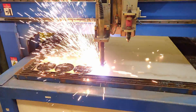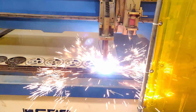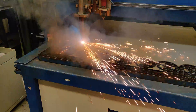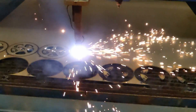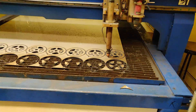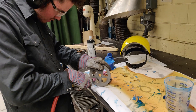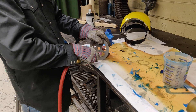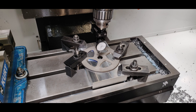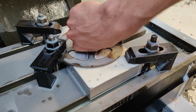For the final product, I am using a quarter inch plate of 304 stainless steel. After cutting all of the rough shapes of the chainrings, I grinded them to take out the rough edges. The next step was to center it on the CNC mill so that I can cut a one inch hole in the middle. This step makes it easier to center it on a lathe.